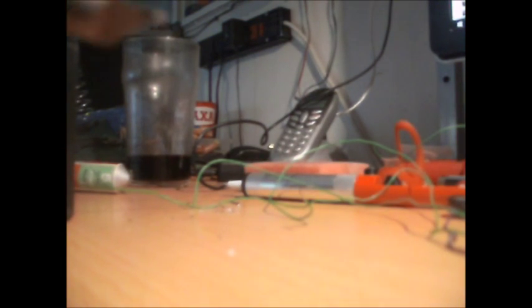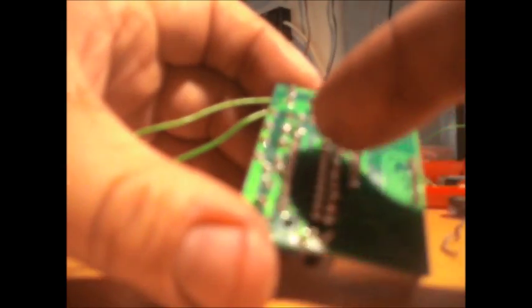No, I was just thinking about that buzzer. I did change the tip on the soldering iron in the end for that one, just because it's got that nice point and I could actually get into the tighter spots easier. And I actually did this systematically. I did the stuff on the inside first, so the IC socket and the resistor strip first. Then went to the end, started on the inside and worked out. Switch I worked down, and so on. Just so I didn't accidentally catch a solder joint I'd already done. Because you don't want to undo your work, so you do need a bit of a system, or a bit of method, whatever you want to call it.